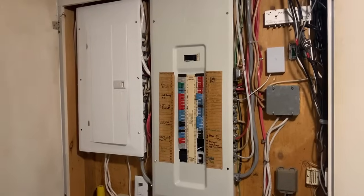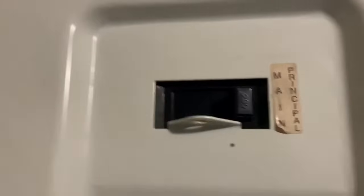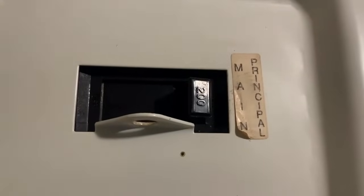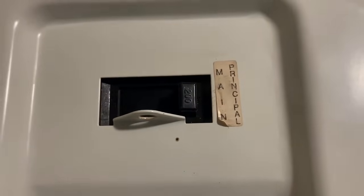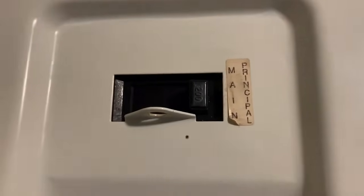Now we'll go inside and look at the main panel. Behind me is the inside of the panel we looked at outside. There are a couple of different panels here, but you're looking at the main pipe coming through — that's the panel right behind me. This is where people get confused: you're always going to look at the main breaker on the front of the panel. You can see in the light it says 200. Now this is not always visible, which is why I said to start outside primarily with your pipe. That pipe from outside — the two-inch pipe — comes into this main 200 amp panel.